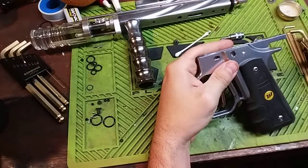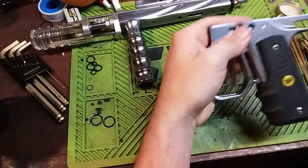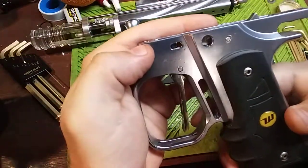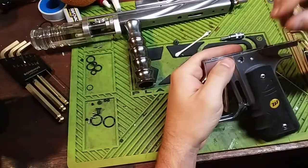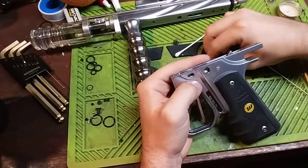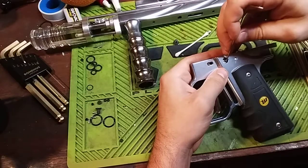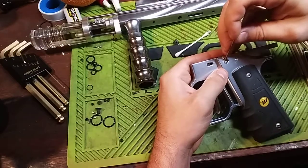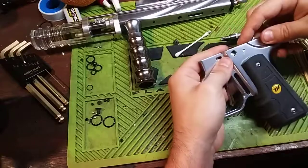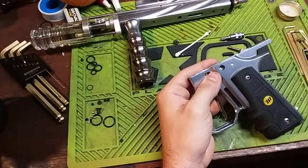We're going to take our little tiny spring and slip it through the top hole, God willing, into the bottom hole. Take a little allen key and just work it down. If you can see, that spring is just sitting up a little bit in there, which means we have enough room that by the time we put the ball on there we'll have to press it down, which puts a little tension on it — and that's where things go wrong. Drop the ball in there, try to get it to sit on top of the spring. This is a lot like those little crappy puzzles we used to have as kids.